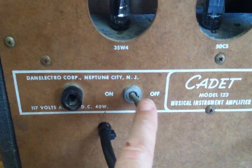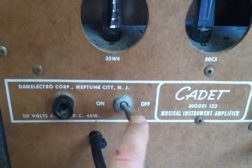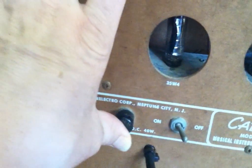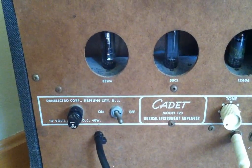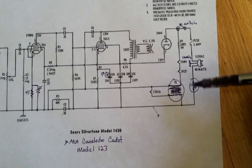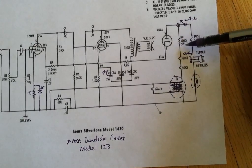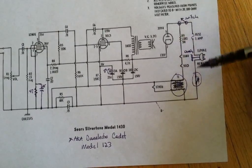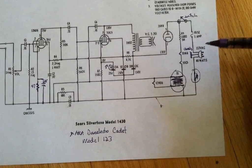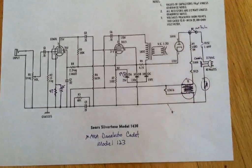What I could do — and I've decided to go ahead and do this — is move the switch to the other side of the fuse. I've eliminated it from this side so this is all continuous now, and moved the switch to the other side of the fuse. If you're planning on doing all these changes, moving this switch is pretty essential to having all of the AC completely shut off and no hum when the amp is in the off position.